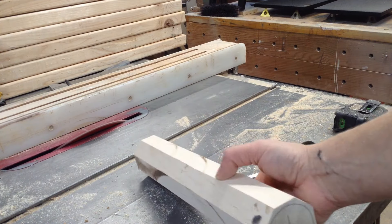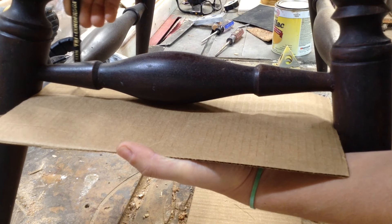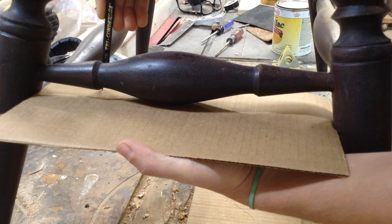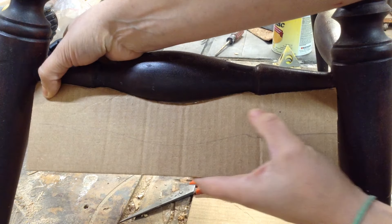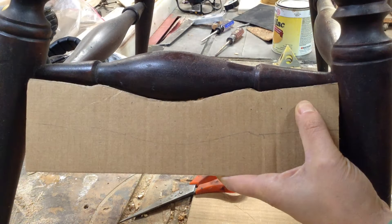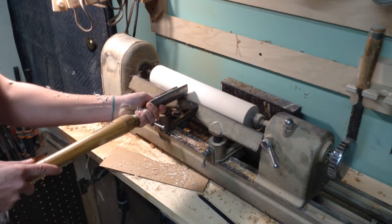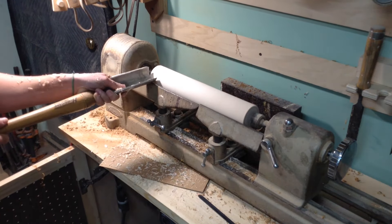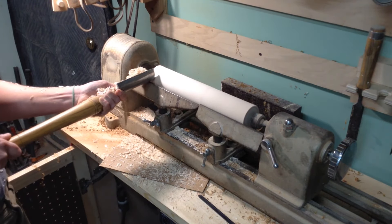On the rung that was not broken I made a pretty quick, simple pattern. I traced it with a pencil, rough cut it out, and then snuck into the dimensions until I got it to be just about a perfect fit. Then I could take this to the lathe and check my piece as I go to make sure it gets as close as possible. The couple that asked me to fix this I have worked with before — I told them I'm not an expert at the lathe, but I can eke out pieces.